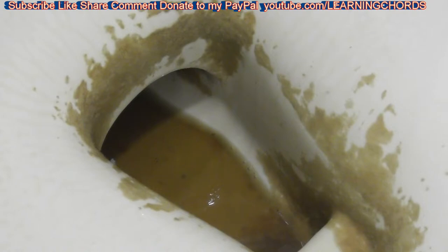And then some of the other videos, they say, oh yeah, it works, but you've got to use a lot of muscle. Well, this is a chemical thing, and if you use The Works, or Lysol didn't do it, you see what Lysol left over. The Works CLR will probably take this stuff off in a short amount of time. So I don't want to use WD-40 and then scrub. And the other video said use a pumice stone. Don't use a pumice stone, it damages your toilet finish, and you will never be able to stop this stuff from growing because the coating, the finish, is gone, and the damage will grow on the area that's not protected, even worse than it is now.